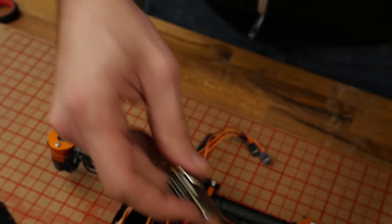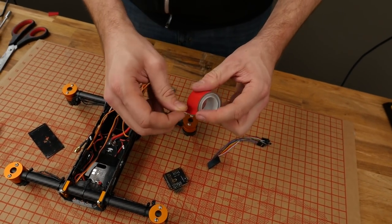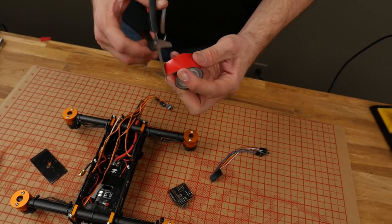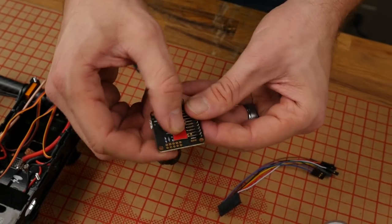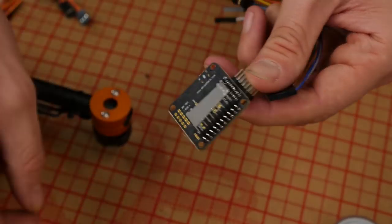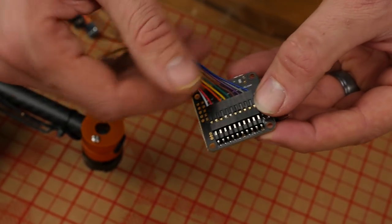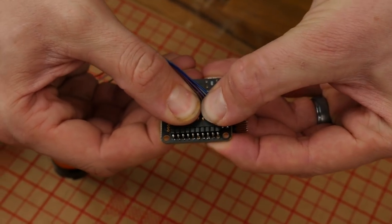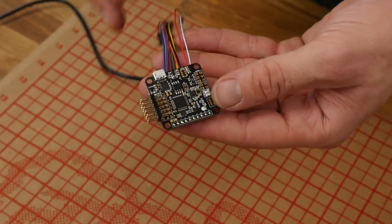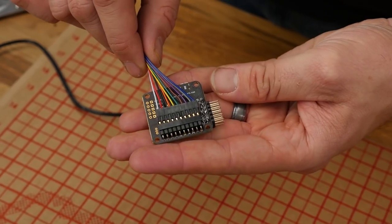I don't want all the stress of this connector to be transmitted to the pins, so I'm going to loosen this up and cut a little quarter-inch piece of foam tape. Apply the foam tape just ahead of the pins, making sure the pin header is oriented correctly. Slide it into the connector, press it in, and press it down against the foam tape. Once everything is soldered, we've also mounted our pins with a little piece of double-sided tape to give that extra bit of security.